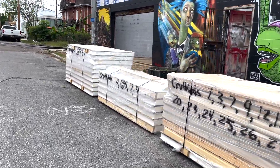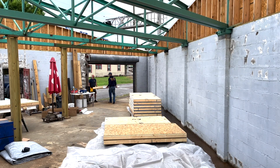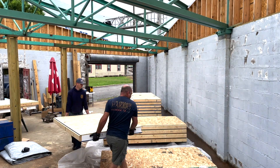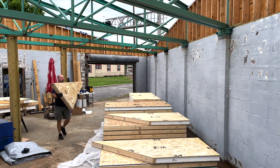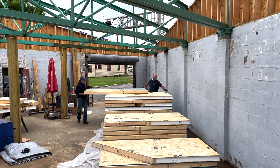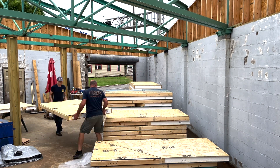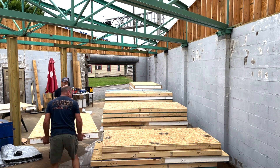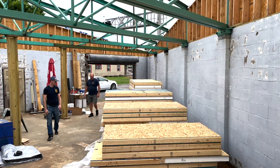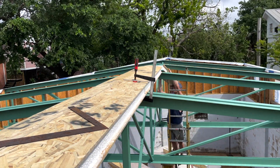The SIPs finally arrived after about 20 weeks. I had no idea how we were going to get these things onto the roof, but the first step is just to get organized. The panels came CNC cut and manufactured exactly to the plans I provided, so each one is labeled for a specific position on the roof. If I modeled everything correctly — and I'm not entirely confident that I did — they should fit together like a big puzzle and we shouldn't have to cut anything. I was giving that about a 20% chance, 60% we have to cut a bunch of stuff, and 20% it's so screwed up we have to get more panels made.